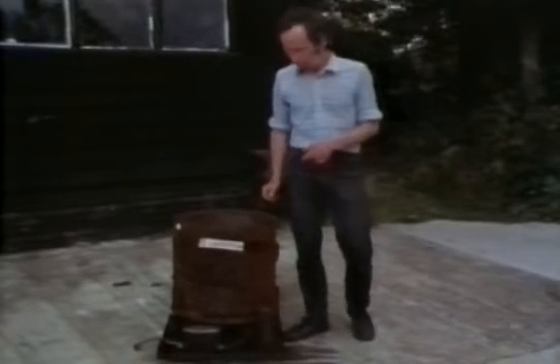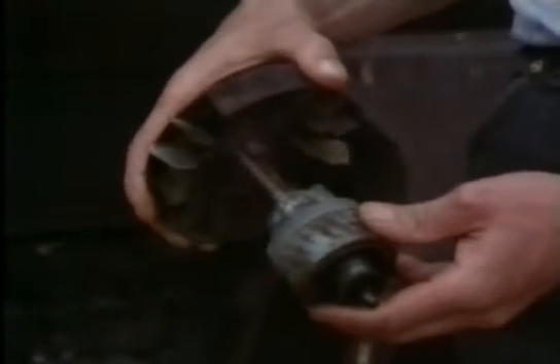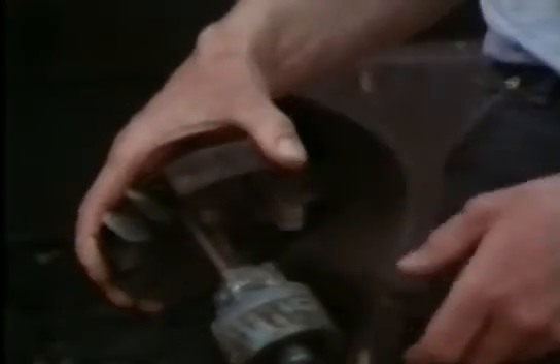This is the wall flame type, and the oil comes in right at the bottom under an electric motor. As the shaft of the motor whizzes round and round, the centrifugal force pushes the oil outwards and upwards through these tubes, and it comes out the end as a fine spray. This spray is ignited by an electric spark.